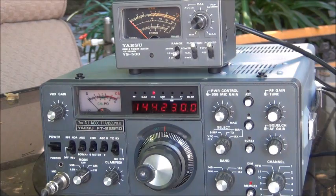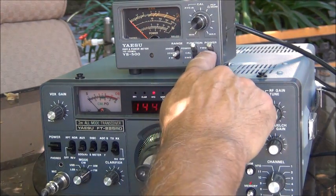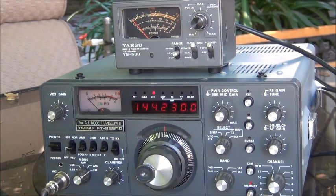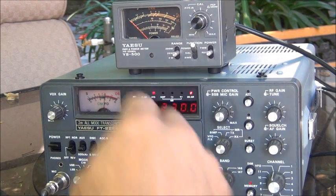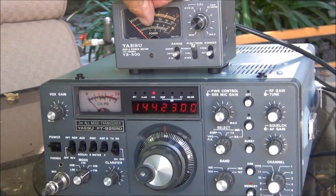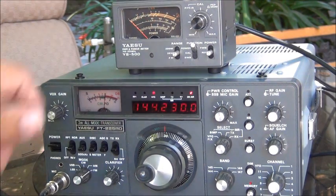Let's look at forward power and reflected power. I'm on power forward — that's 20 watts forward and about... it's next to nothing. The meter hardly moves. One watt is all the way over to here, so it's maybe a twentieth of a watt. N6TWW.